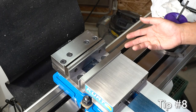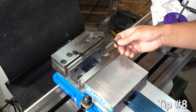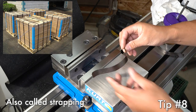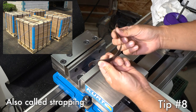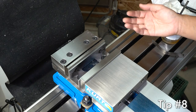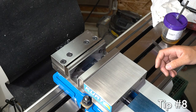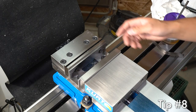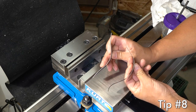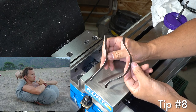You don't have to spend $50 and buy parallel keepers. You can simply take metal banding that comes in wooden pallets and shipments, cut it to length, and bend it easily by hand. You'll have separators that spread out when you apply pressure, so they have quite a bit of range. Make a couple of different sizes so you have more flexibility — and it's free.